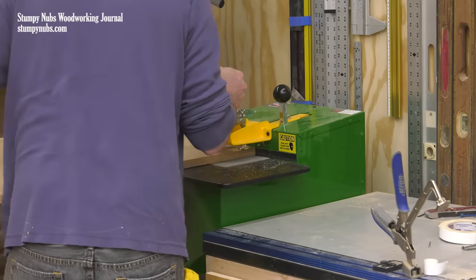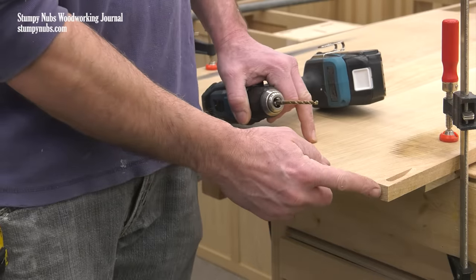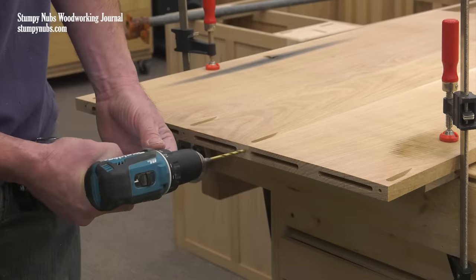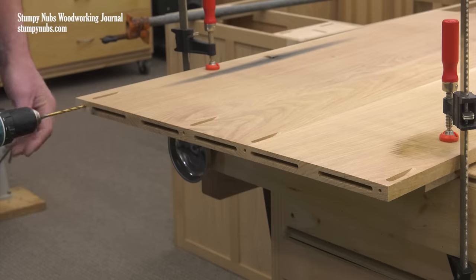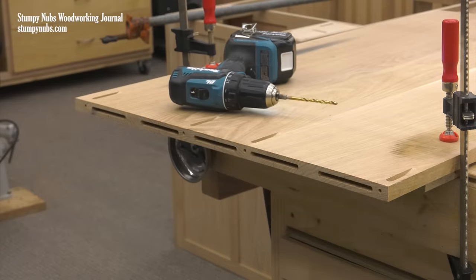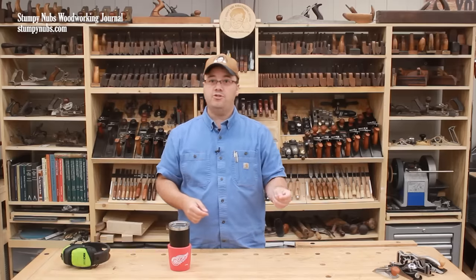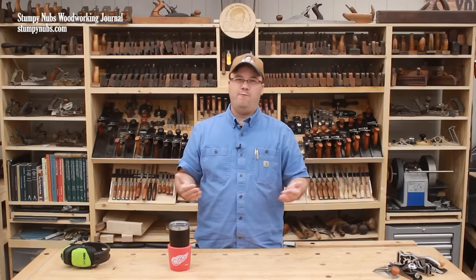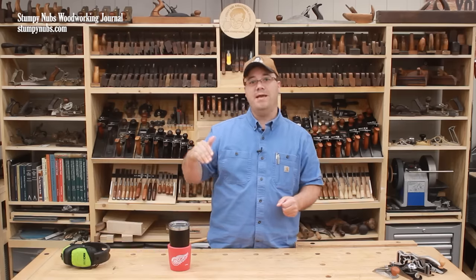No glue at all is used in either the miter joint or the butt joint — instead they'll be held together with metal fasteners. For the butt joint we chose pocket screws. Pockets are bored into the end grain side of the joint, not into the long grain edge, and the exit holes are counter bored larger than the screw's threads. When the joint is screwed together the heads of the screws pull it tight, closing the seam. If over time the end grain half of the joint becomes wider or narrower, the shaft of the screw will not restrict that movement because of the extra room in that portion of the hole. The miter joint might also have been joined with pocket screws but the bond wouldn't have been as strong because the screw threads cannot bite into the mating end grain of the miter joint as securely as they can the mating long grain portion of the butt joint.